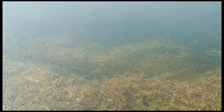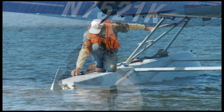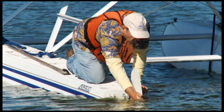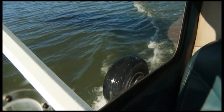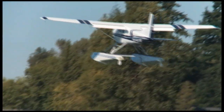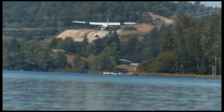If your aircraft must taxi through weed beds to reach open water, you will likely need to manually clear any new vegetation from the floats and rudders before takeoff. Do your best to avoid weed beds to minimize the risk and avoid having to clear the vegetation a second time — always exercise caution when leaving the cockpit in open water. In the case of some types of amphibious aircraft, you may also need to cycle the wheels to clear any additional vegetation. Always cycle the rudders and wheels before leaving the dock. If you're unable to safely clear vegetation from the gear after taxiing through weeds, be sure to cycle again over the departing waterway or land and visually check to make sure no vegetation remains attached before proceeding to the next destination.